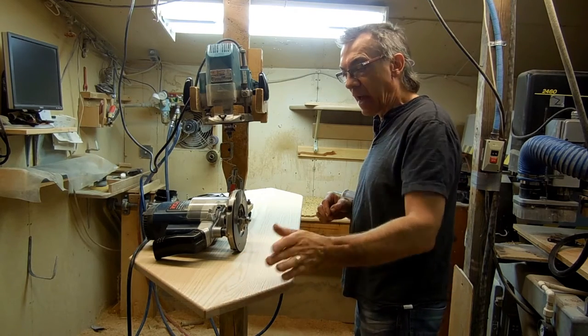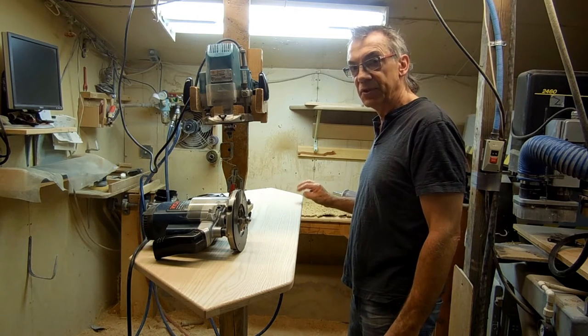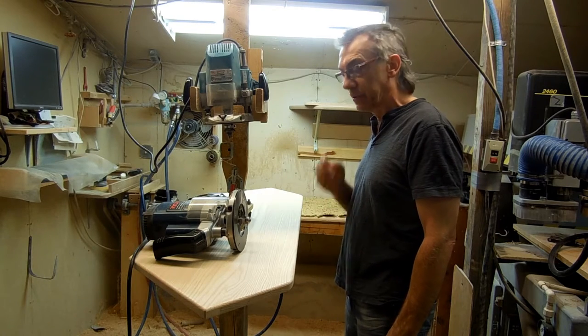It's not taking a full cut — about three quarters of the wood is being pulled away, so you're just not ripping out the wood. Then when you come back, you lay the router bit right against the wood, taking off just a little bit, and that gives you a really nice clean profile. I have never had a panel rip out doing it that way.